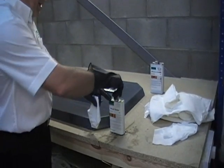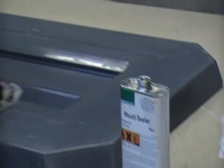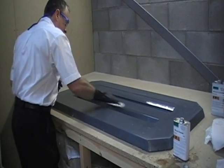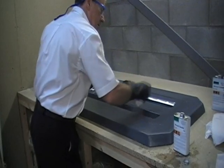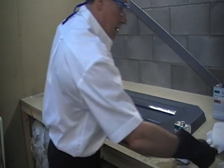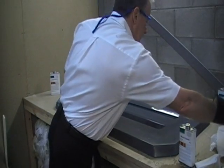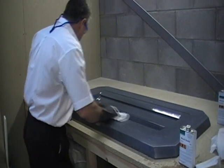To apply the mould sealer it's quite simple. Wet the cloth up and wipe a wet film over the mould area. As with the mould cleaner, work on areas around about half a metre to a square metre. Make sure you get it into everywhere — a continuous wet film is what we're looking for. It's very important to always put the lid back as soon as you finish using the product because it uses moisture in the atmosphere to cure. After about 30 seconds you'll notice that the mould sealer starts to separate — take a separate dry cloth and using light finger pressure just spread it.